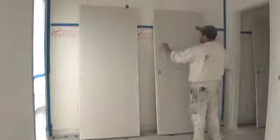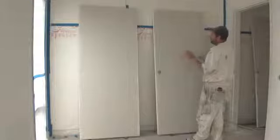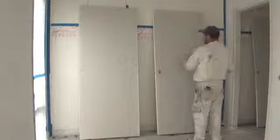I'll normally hold the gun roughly halfway, so half the spray's going on there. Because you always have to overlap by 50% — you spray there, then the next pass comes out to about here.